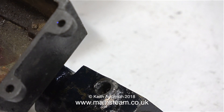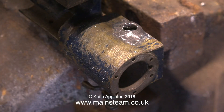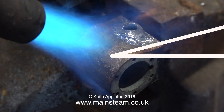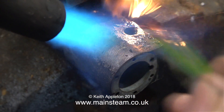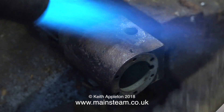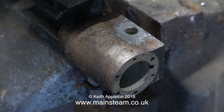Further bearing out the evidence that more than one person worked on this engine is this mess underneath the cylinder — this is soft solder, it's the way the exhaust pipe has been soldered in. I can't live with this, it's got to go. So it's into the outer part of the workshop, and I'm going to use my blow lamp to melt the solder, after which I'll be able to brush it away with this old paintbrush. Passing the paintbrush through the flame like this is not a good idea — this is not lack of synchronicity on my part, it's just stupidity. A quick touch with a brass wire brush and it's now fairly clean.